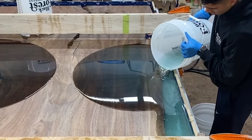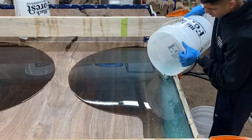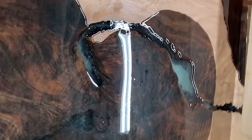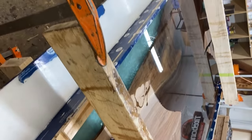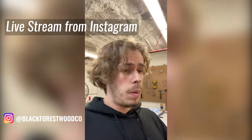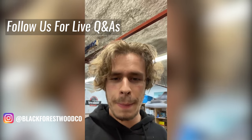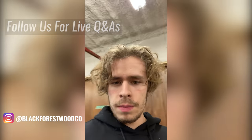Only one more bucket here — I'll give you guys some close-ups. You can see that curl coming out of the wood there. This will sit in here for about a week to cure up. We like to cover the whole surface — we're just sort of flush right now. We want to cover that whole surface so that when it cures, if anything soaks into the wood, we're still going to be above the surface. Then we plane it. We pour this in, we go over top, we let it cure, and then we plane it back down to the raw wood. The overlay or overpour of the epoxy doesn't stay on the wood — it all gets machined back down.